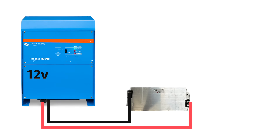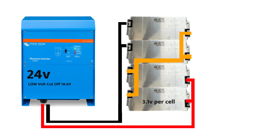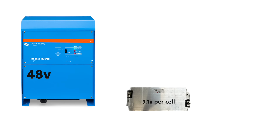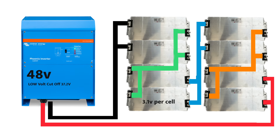The last few percent will trigger alarms that drive you nuts. But here's the great thing: with a Victron inverter you can set the low voltage cutoff as low as 9.3V for a 12V system, which puts your cells at around 3.1V — perfect low voltage cutoff. For 24V the minimum is 18.6V, achieved by running two modules in series — six cells — again landing at 3.1V per cell. Same math applies for 48V with a 37.2V cutoff.